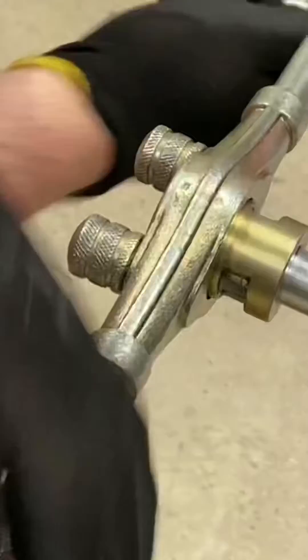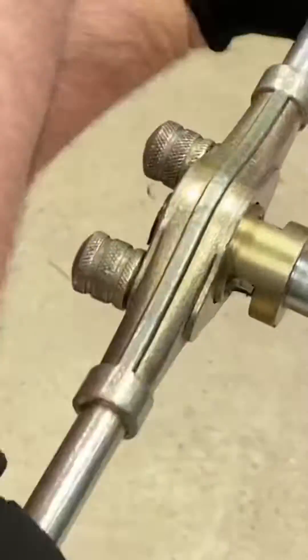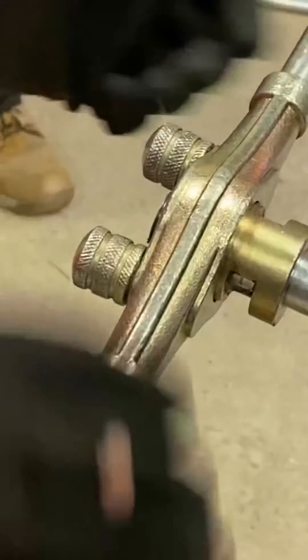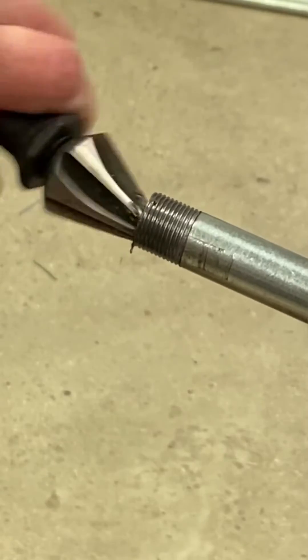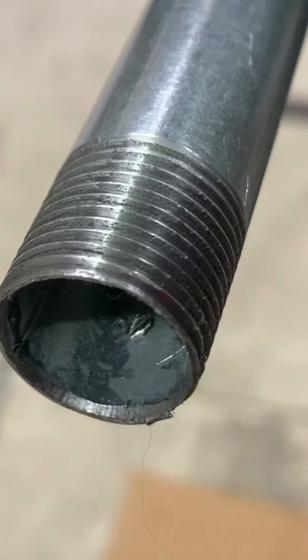What I want is about three threads hanging out the back of the stocks and die. So for our first ever thread, we count about three threads coming out the back of the die, bring our reaming in, and there we have it — that's our first thread done.